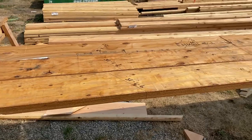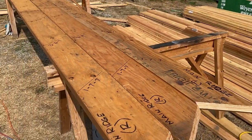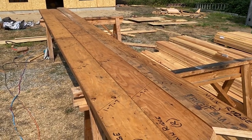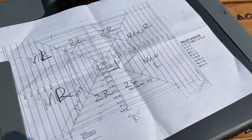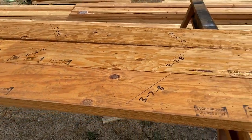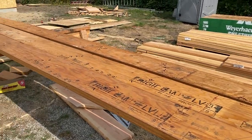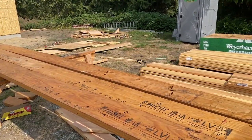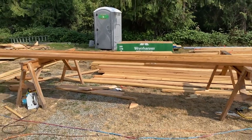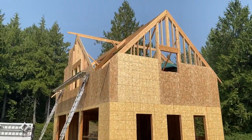Okay, this is the main side — as in the thicker three-and-a-half-inch main ridge. Then I'm going to flip these over and lay out the corresponding two-by-ten ridge jacks. Got these remaining three valleys cut and laid out. In the old days we never used to lay out the hips or valleys, but since I can, I do — because it just helps. If I cut a rafter wrong and it doesn't land where the layout is and the guy up there nails it in anyway, now it's out of layout and it's crooked. And there's the main valley that's in there.